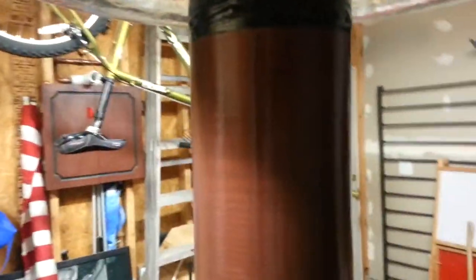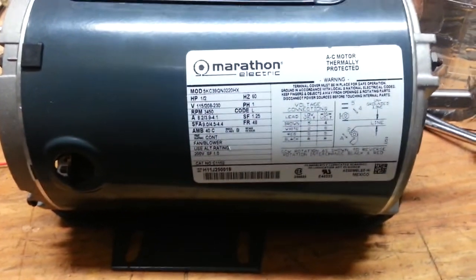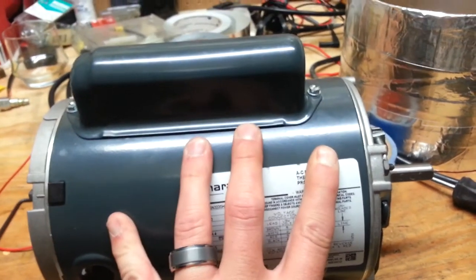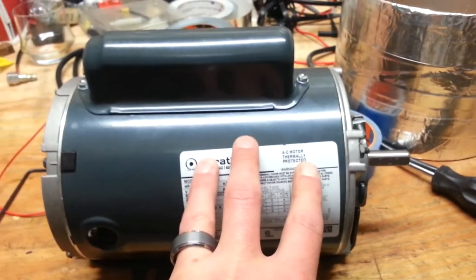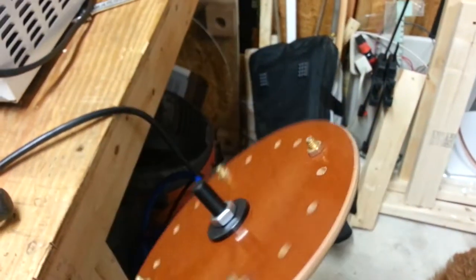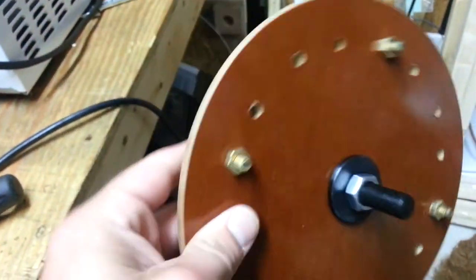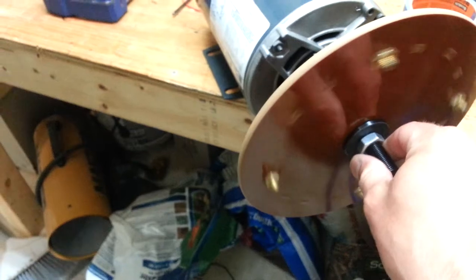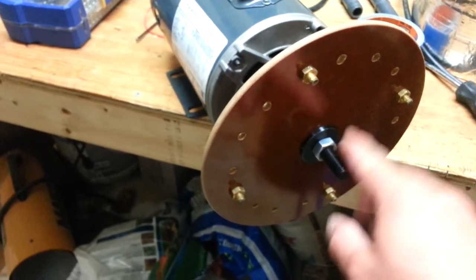She's just about done. Feeling pretty confident with the toroid and everything else after last week's run. This right here is the new edition — Marathon 3450 RPM, half horsepower. I'm going to be bringing this down to the group and working with Chris to make it sync, putting it on a CNC mill to get it all milled down. I threw my original spark gap disc up — a poor attempt on my part — but it actually mounts up pretty solid. I've test run it a few times and got it to balance out very, very well even as it is now.